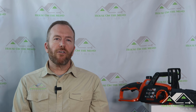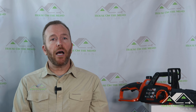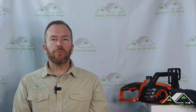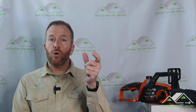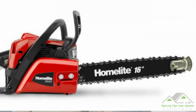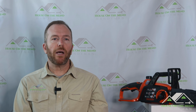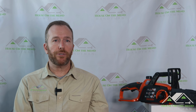So who's this chainsaw for? I would recommend it for anyone needing to cut softwoods like pine and aspen, but not for hardwoods like oak or maple. It absolutely struggled with the 9-inch African Sumac. There is no anti-kickback nose on the front, so be very careful not to use the tip when cutting, which could cause the saw to lurch up and cause injury. However, the lack of that nose combined with its light weight makes it potentially useful for ice and log sculptors.